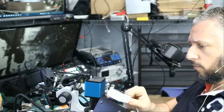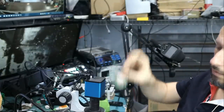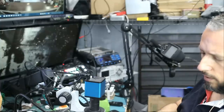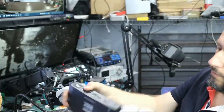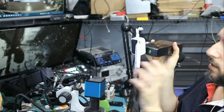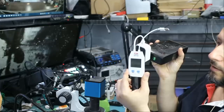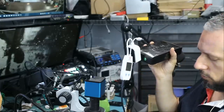Big Boss already removed the board. This is the board for the Nintendo Switch. Plug it in and let's monitor the amp meter to see if there is any signs of life. And nothing. The power bank is on, but look at the meter. It's totally black. Nothing. Dead. So it's not seeing that we have the cable plugged into the switch.